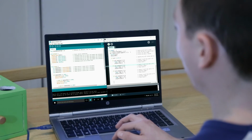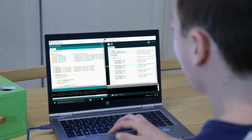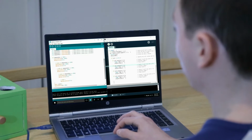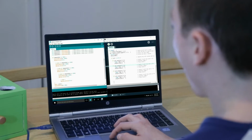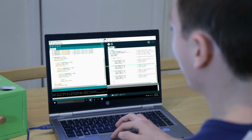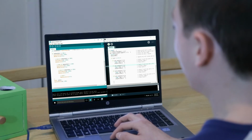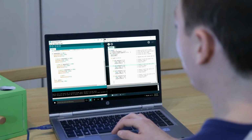Next we use the 4 sensor values, the 4 switches, and we put them into an integer, which is read by each of the ports or the pin modes that we spoke about earlier. Further down the code we have an if-else statement, which says if one of the shapes is entered, so say the triangle is entered, it will produce an A. If the diamond is entered, it will produce a B. And when this happens, the LED turns on and it serial writes the letter in question, and that means it pushes it over to Processing. At the end of the if-else statement, you can see we have an else clause, which basically produces an E at all times when nothing is entered. This prevents the program sending a null, and null in this case can break the code.